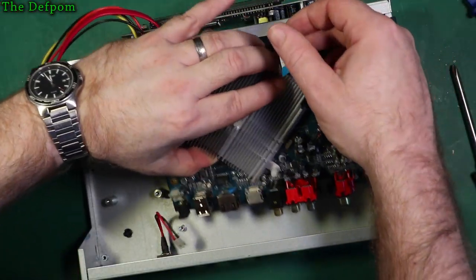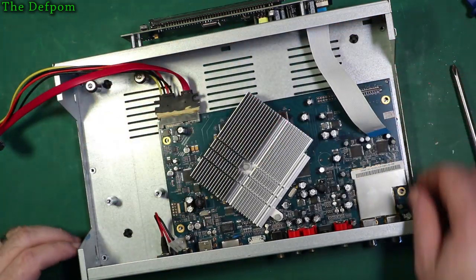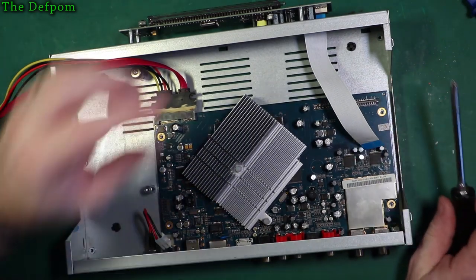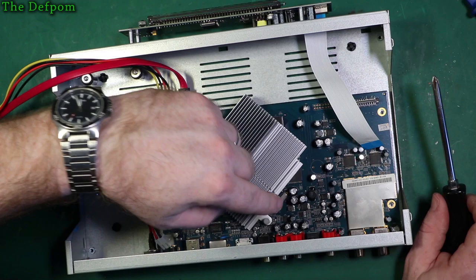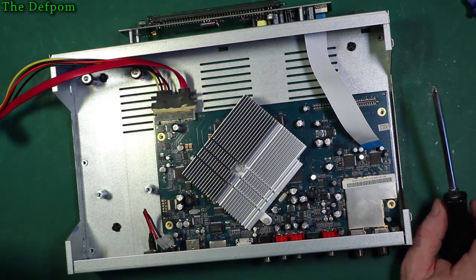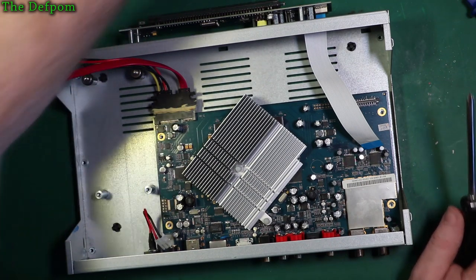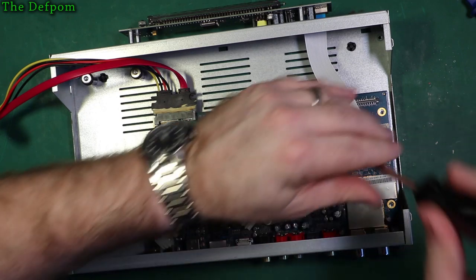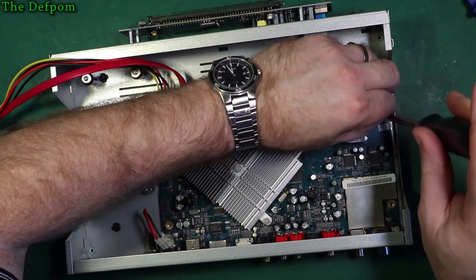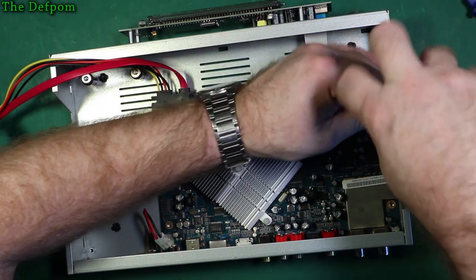What I might do is, I'll do a retest on it, obviously, by the TV, and if it plays up, maybe I'll get in there with the heat gun and just heat up areas of the board, or maybe cool down bits of the board and see if it changes the issue. Because it's entirely possible that if it's a capacitor, then you can actually affect the fault, and I might be able to trace it down to a particular section of the board.